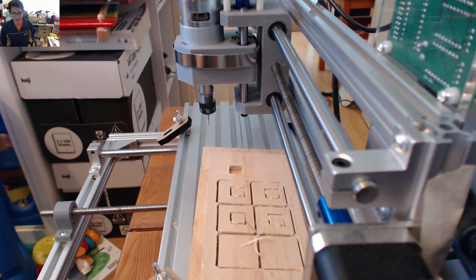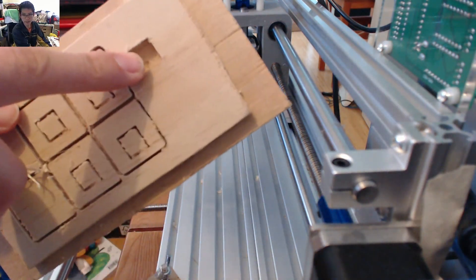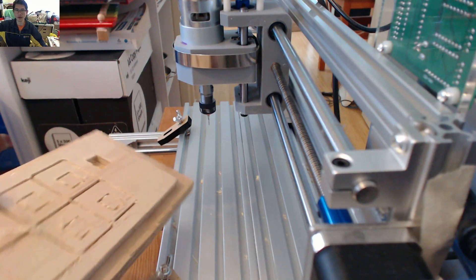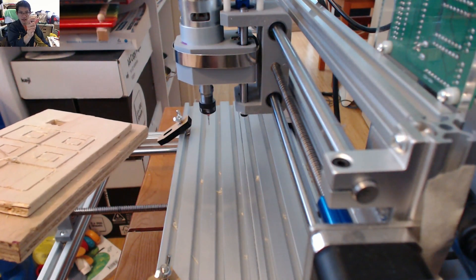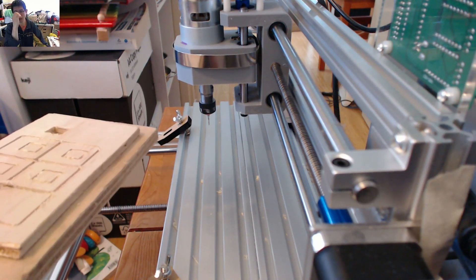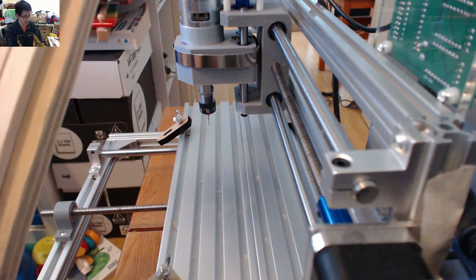Okay, so we're back. That took a little bit longer than I was thinking. You may have noticed I kind of stopped it — the first cut had the plunge depth set to 8.5mm because I wanted to make sure I went all the way through the 7mm board. But what actually resulted was it was crashing the conical top end of the bit. The cutting depth for this 1.5mm bit was not 8.5mm deep, and it ended up ripping the piece out.